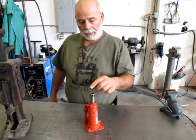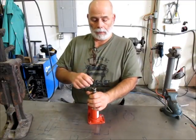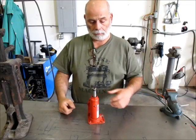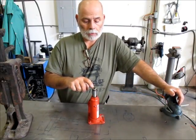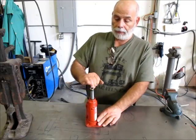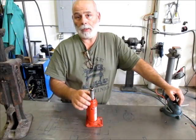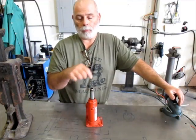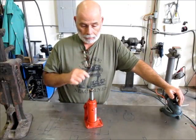So anyway, I got to thinking about it. I had to repair this jack here. It has a little threaded foot in the tip, and I went to use it and I picked it up by the little threaded tip and it came out of there, and I was like, oh no, okay. So I said, okay, well, I'll fix it. And so I machined a little threaded bushing, and I put it into the end of the hydraulic ram here. And then I used silicon bronze to weld it in there. And I was very careful. I extended this up. I didn't want to injure the seals, right? So I extended this up and put some cool rags around here and just kind of backstep welded around that and let it cool off in between, so that this thing didn't get hot and wreck the seal. And it seems to have worked fine.